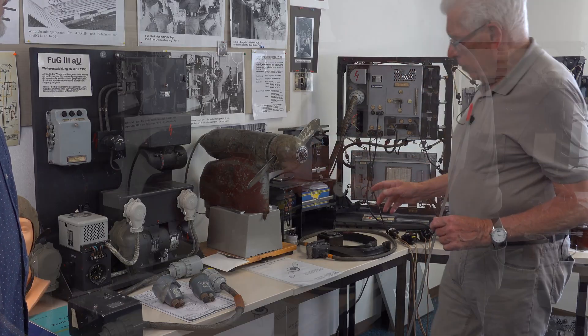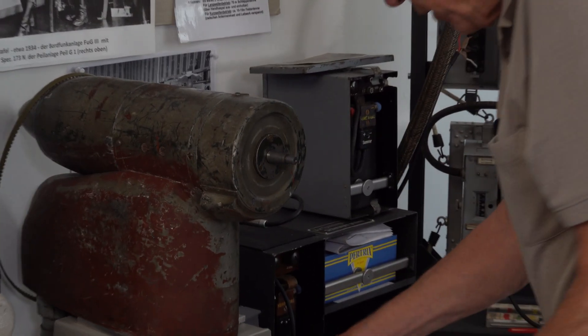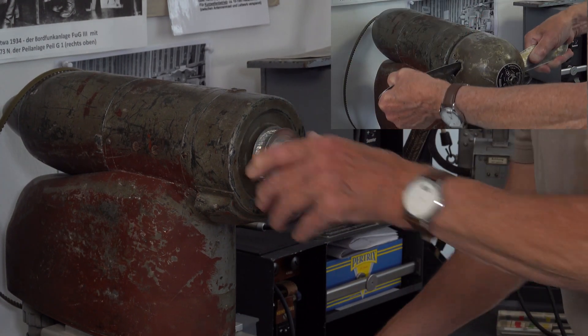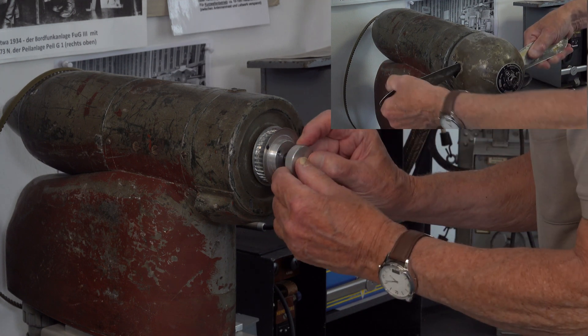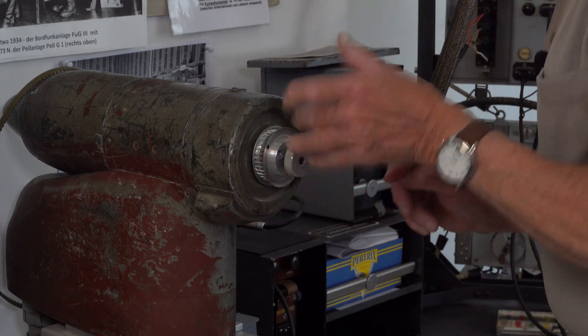To show how this machine works we need power, but the power came from the wind generator and we don't have enough wind here. So a motor was fitted to drive the generator. Notably, the boss or hub of the wind generator's propeller has a speed governor that automatically varies the attack angle of the blades to keep the rotational speed constant.